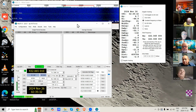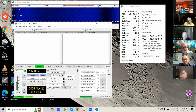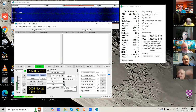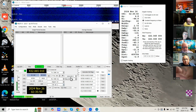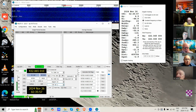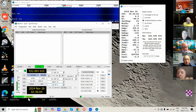Oh, you know what I didn't touch on was how to change to 60B. I'm at 15B because that's what we use for aircraft scatter. Let me quickly show you that in case people are wondering. So down here is your transmit receive period. And you go 1, 2 to 60 seconds, and we're already at mode B. So there we are. This little window down here in the corner is a nice thing to remember. If you forget where you're at, it summarizes it right there. Q65 60B. This seems to be the one that people are excited about.